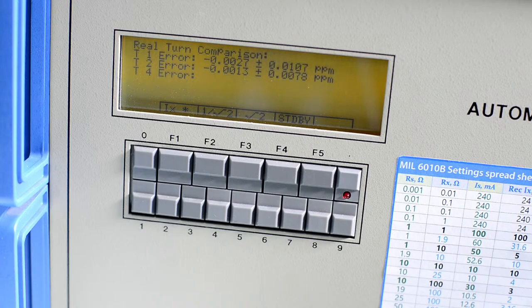And you may notice that I didn't wait for any warm-up. I started the test right away. So even despite we changed the parts and the bridge is open right now, there are no metal covers on top, it's still giving these amazing numbers. Magic of direct current comparator bridges.